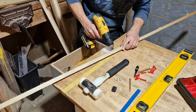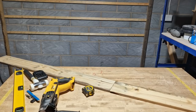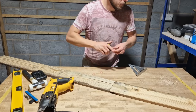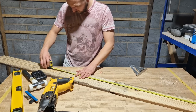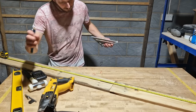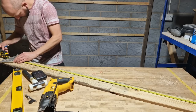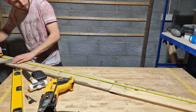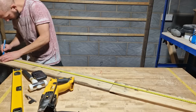I'll skip attaching the cleats to the wall and get to the next part — which you get to watch me screw up, basically. I wanted this project to be a little bit fancier than just some French cleats on the wall, so I'm going to add a little bit of lighting, especially now I'm getting into this YouTube thing. I want a bit of a background like all the professionals have. I'm going to make a bit of a shelf with some hidden lighting up on top. I'm using some old pallet boards and measuring them to the width of my French cleats, then cutting them down.